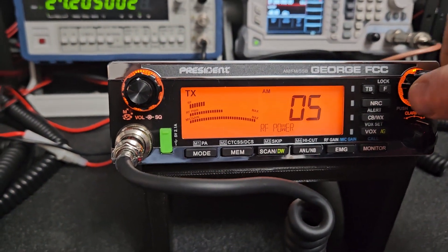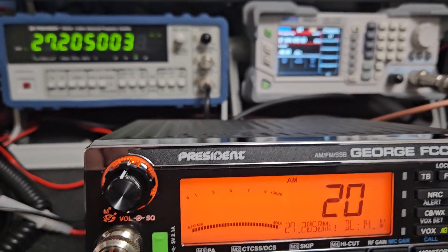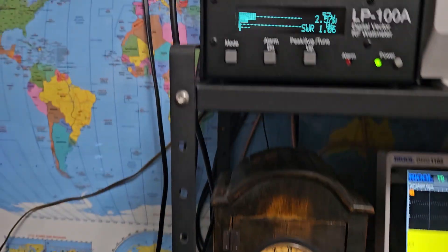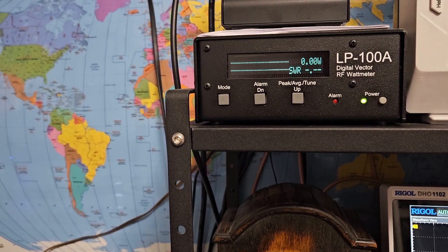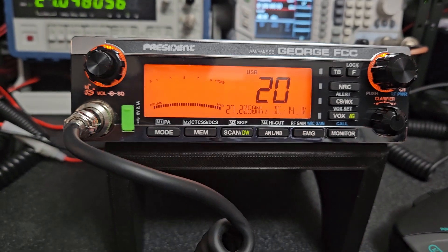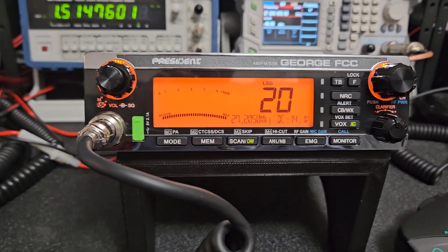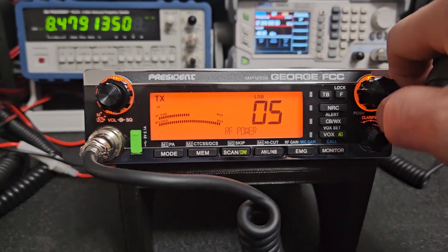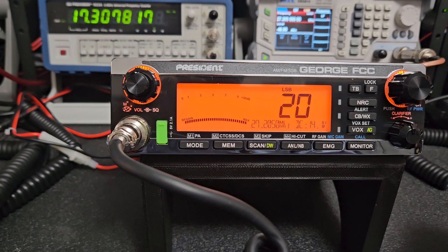The peak power of the radio is about 20 to 25 watts somewhere in there. If you turn it down about halfway it's about 2.5 watts, which is about right. So if you don't need to run that full power you can run it lower. One, two, three - check check - it still does pretty good. We'll skip FM, that's one watt. We'll go to sideband here, key this back up, turn this back up all the way.